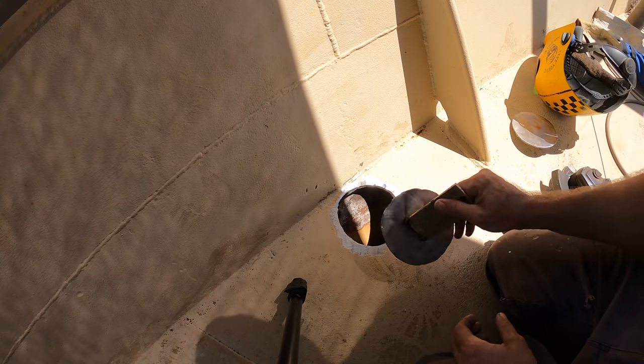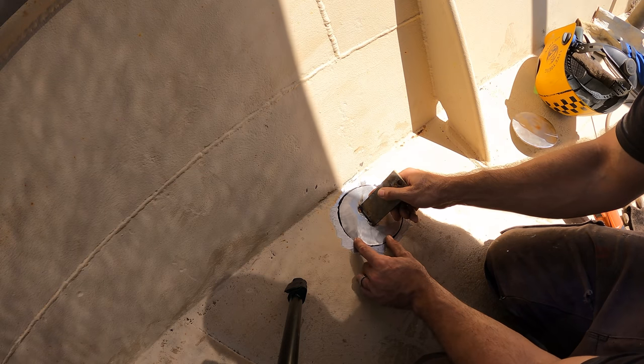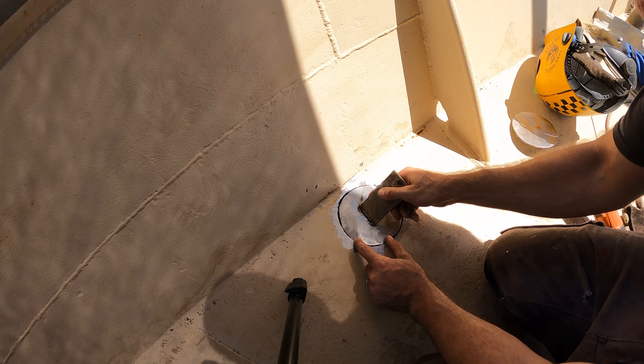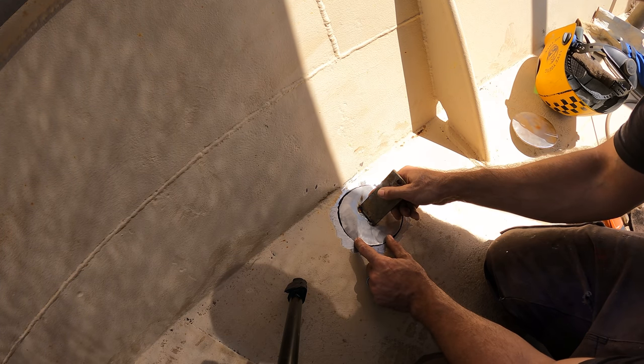This is one that Jess cut out the other day, and we just knocked this 5-inch hole, and I did about 10 seconds of tidy up, and look how good that fits, beautiful. So we're just gonna TIG this in. I've got everything up here, we'll just blast it in now and get that sealed up.